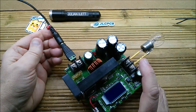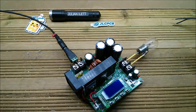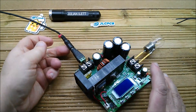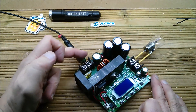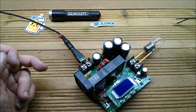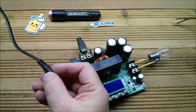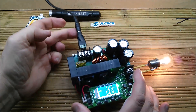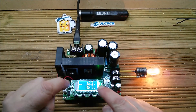Nothing happens — I've got an error message on the power pack. I think the instantaneous current rush into the capacitor, which is straight across the input, is causing a problem. Let's try a different source. This one is from the cigarette lighter output, so that's going to be about 12.6 volts — and yes, that works fine.